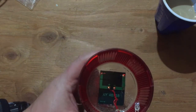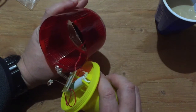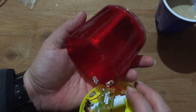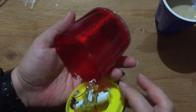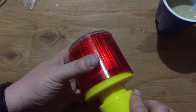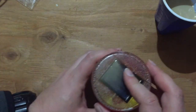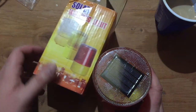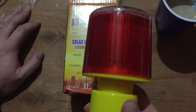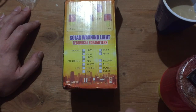There's the solar panel and a switch, which goes to one side there. So you're just disconnecting one side of the battery when the switch is off, which also means it wouldn't be charging — so it has to be on to charge. This cap looks like it's just glued on. You want clear for the solar panel, but it looks like it's available in multiple colors. Banggood only has this one specific model, but it looks like there's five styles of light, four possible colors, and different numbers of LEDs you can order.